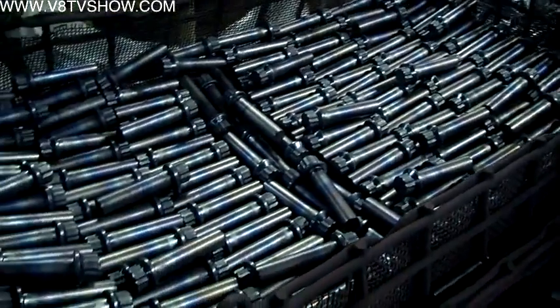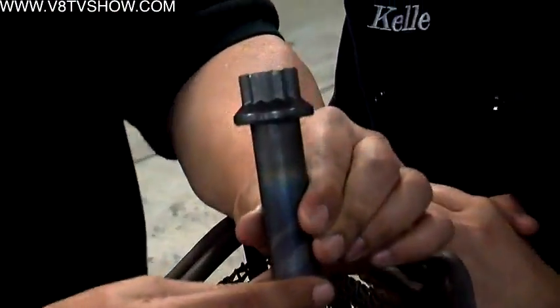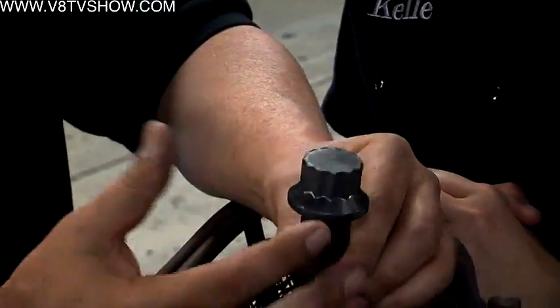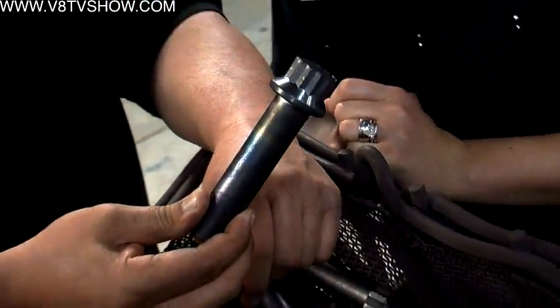All of our products are heat treated before thread roll. This is an LS1 dampener bolt — it's been hot headed and it's a really big blank. Now it'll go into the furnace and start the heat treat process. From the factory, those types of bolts are a one-time use bolt. Yeah, that'd be a torque-to-yield fastener — most of the cars today are manufactured with torque-to-yield fasteners.